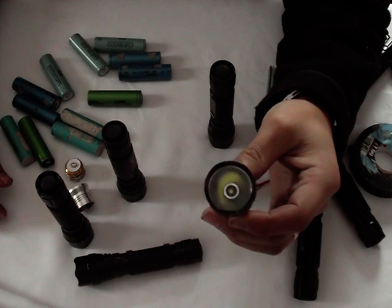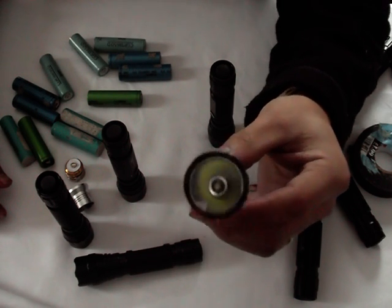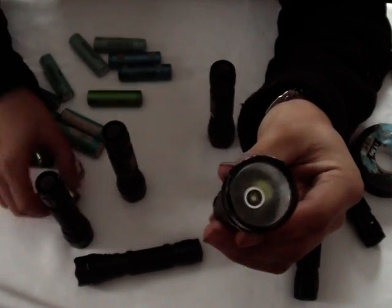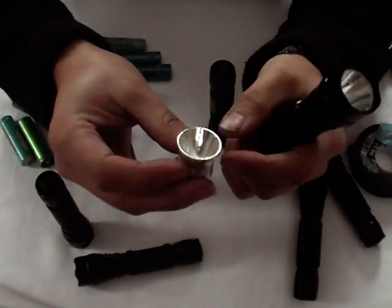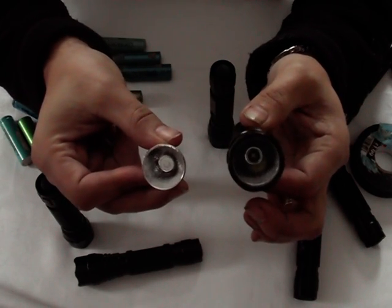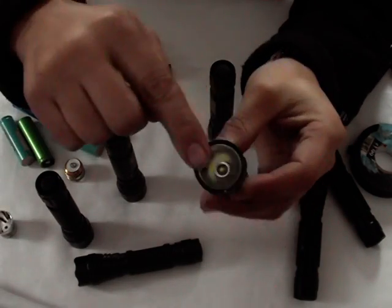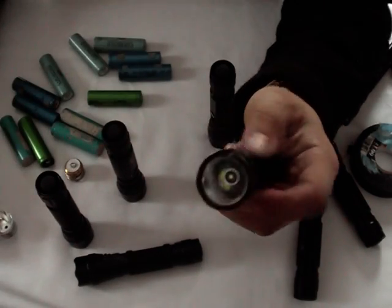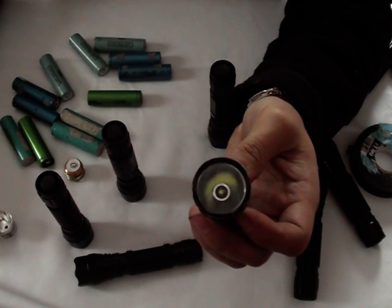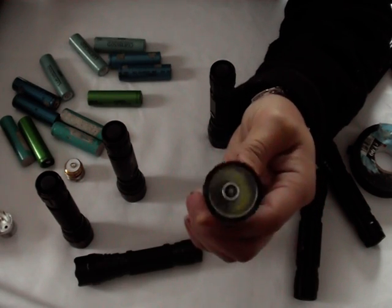These are modified in the sense that I've modified the reflector to increase the amount of light that can come out of the chip. The reflector I've got in here is actually out of an XRE chip. The original reflector has a much smaller hole and given the fact that these are very cheap torches they're often not manufactured particularly well and not all of the light necessarily gets out through the emitter, so I prefer to run mine with larger reflectors. It makes the spot a little bit more floody but for night mountain biking, which is what I use them for, it still makes no difference.